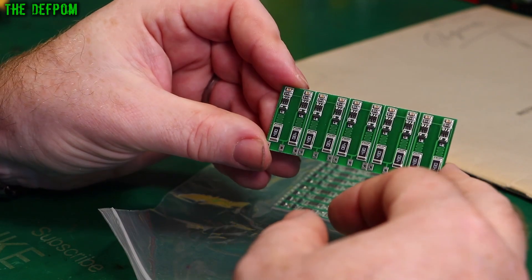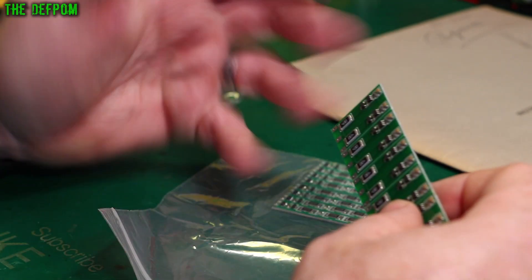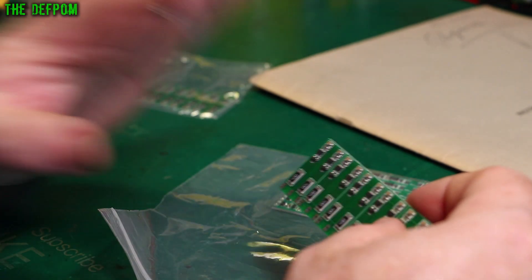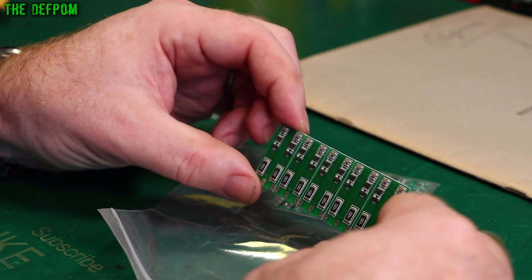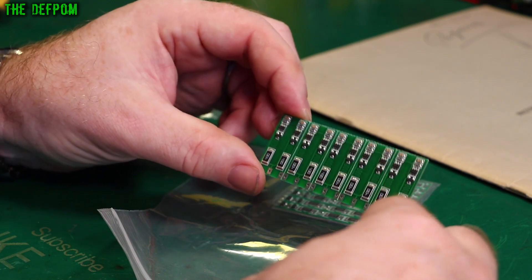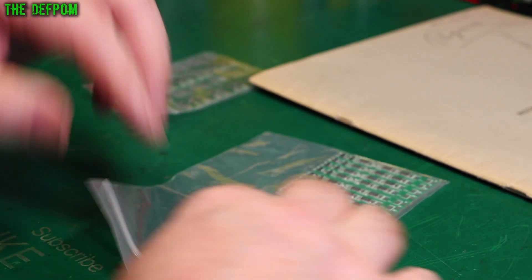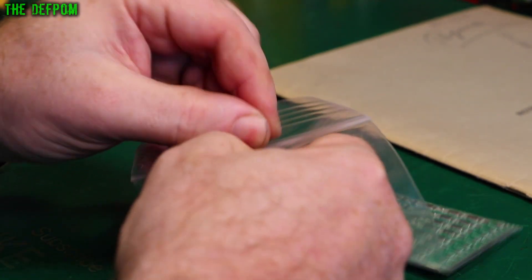These put a load across the cell and actually discharge the higher cell, in order to give the weakest cell a chance to charge up. I realized that these projects I've been making using lithium cells had a BMS on them, but a BMS isn't doing any kind of balancing - it's purely doing charge limiting and discharge limiting, and that is it. I actually had one of my projects which I built a few years ago, and I noticed it was not working correctly.